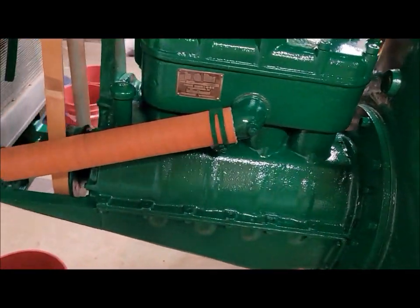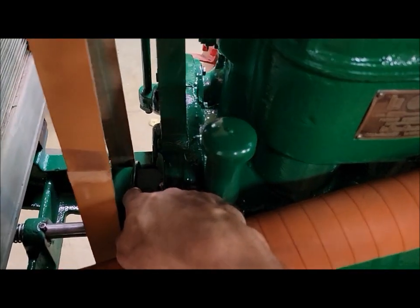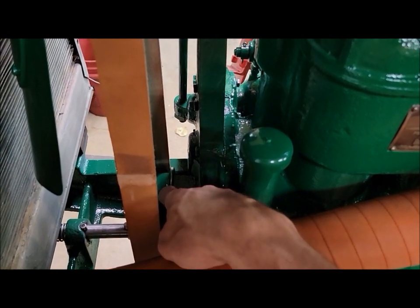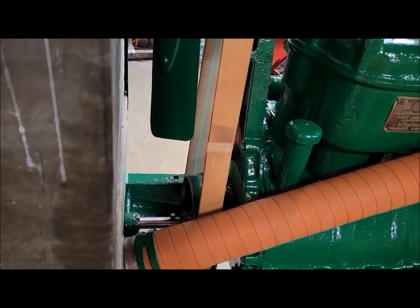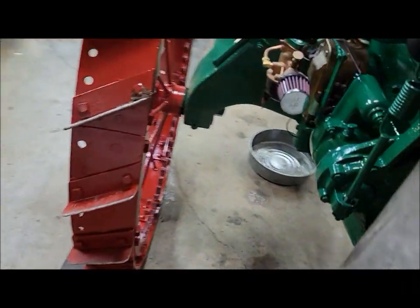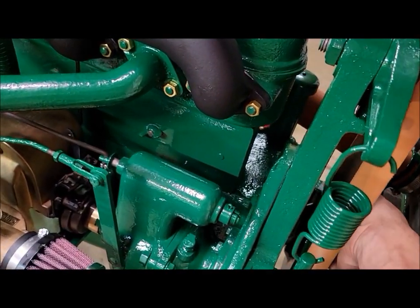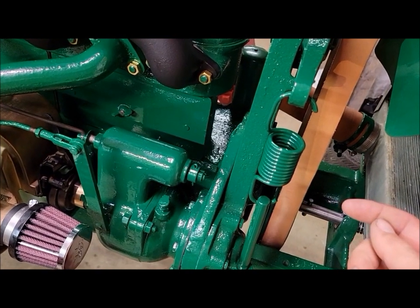So basically, I had my timing mark on my front pulley, my top dead center. When I put the engine together, I made a little chisel mark on the front of my pulley. So we used that instead. Same concept, but instead of using the flywheel, we use the front pulley because it's easier to see. We took the fan belt off, and so what we did is you measure the circumference of your pulley, do the math,